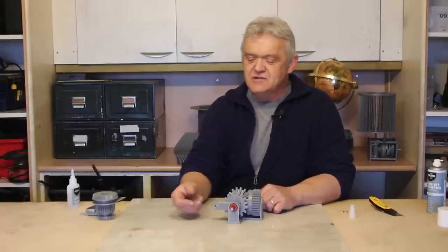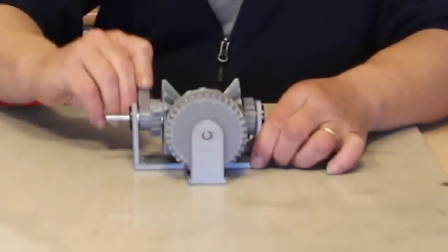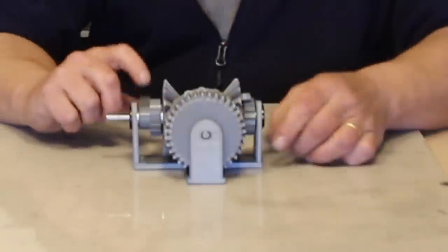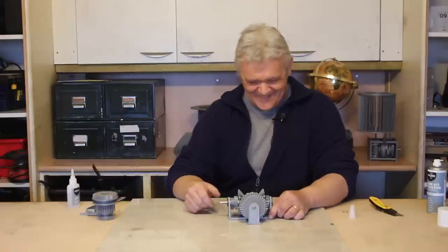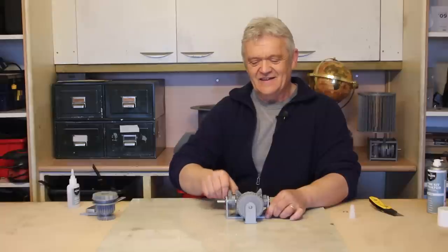And that is it complete. That arm can wobble up and down — obviously we'd attach it to something like a bottle, and the bottle would go up and down with the waves. Because it's got a ratchet facing that way and a ratchet facing the other way, as I move that arm up and down you should see that the output gear is only going in one direction. That's very cool! It does that because the ratchet catches and drives one gear or the other using the pawl on the ratchet.